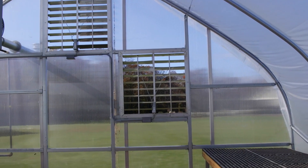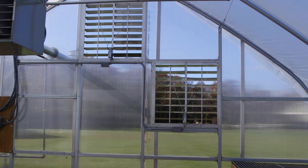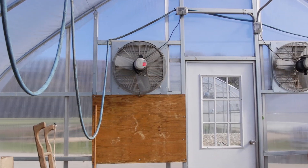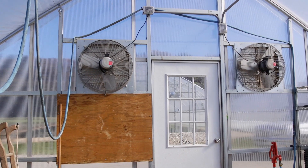You've got the louvers at the ends and then these circulating fans. The louvers are basically on one end and the exhaust fans are on the opposite end. The key of the exhaust fans is they are blowing air out of the house and drawing fresh air from the louvers all the way through the house, so that every minute you are constantly exchanging indoor air with outdoor air — fresh air coming in. We maintain humidity too.